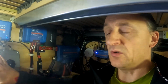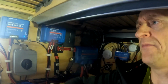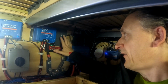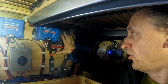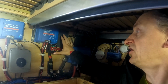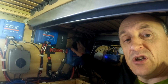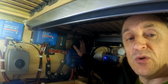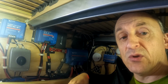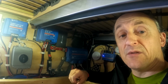Right, it's now in and powered, so I've connected onto the fuse box there. Sorry about that, light's a wee bit bright. And then I've got the Ethernet cable from the Nighthawk going into this. Also, I've got the Ethernet cable from the Starlink going into this, and then the lead from this goes out into the router. From the router here, this does all the Wi-Fi, and also I've got the RJ45 for the front of the van, where I've got a hookup so I can hardwire my laptop in. Now it's just a case of getting onto the computer and configuring it.